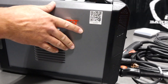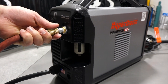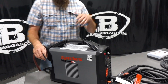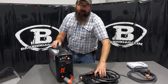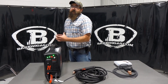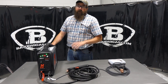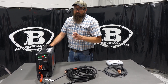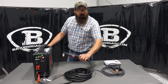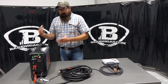It's got a built-in air condensate separator, so it separates moisture out of the air. Hypertherm also recommends buying an additional one that mounts to the back — we'll link that down below. I've run a lot of Hypertherm power supplies, and I always recommend running that secondary air separator. It pulls moisture, oil, and that sort of thing out. It's inexpensive, but it's a lot cheaper than buying a new torch. If you get moisture in the torch, it just wrecks them.